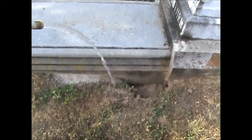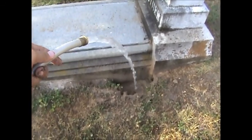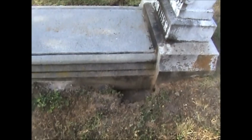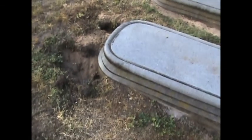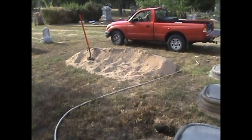That's how we're doing this all the way around — adding a little sand, watering it in, not putting too much water because we don't want to collapse it, then waiting a minute and adding more sand. The water carries the sand down to the void underneath. We keep this up, and you can see we're not quite halfway through — we've got about three quarters of a yard of sand in here now. But this is how it's done.